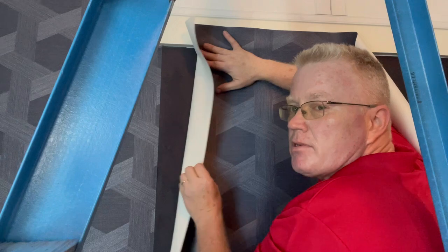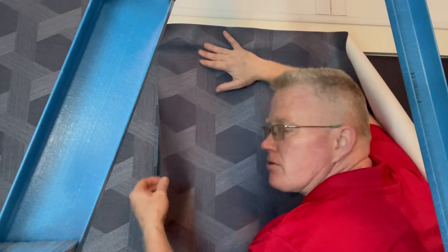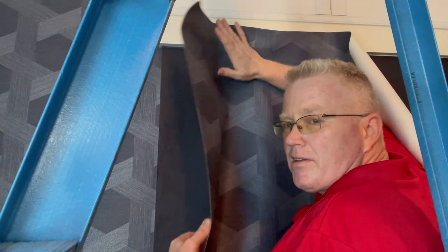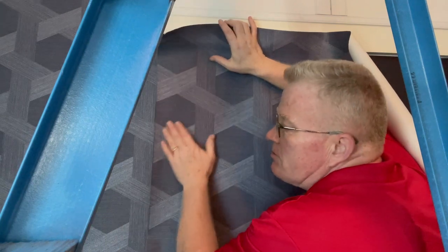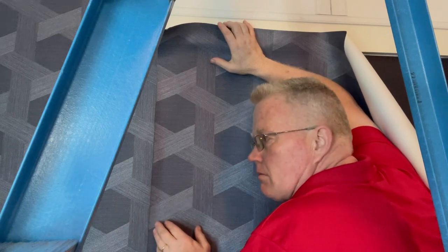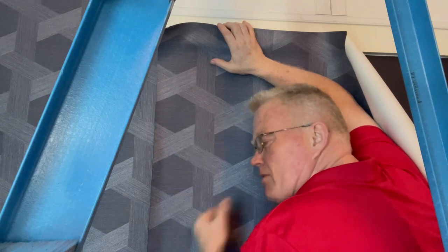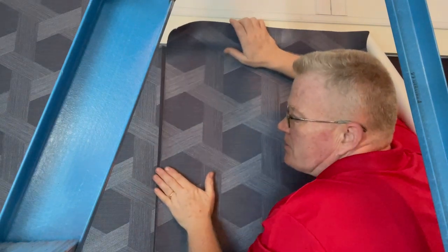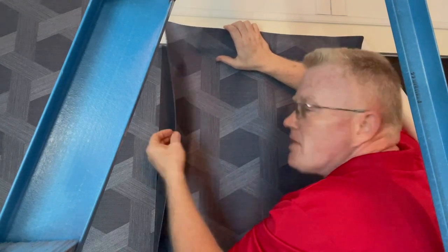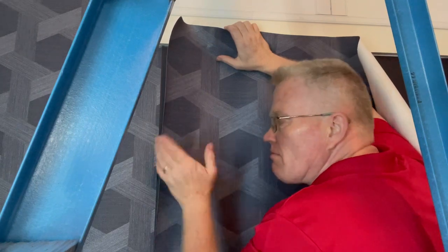What does that mean to the new person? It means this vinyl, when you have vinyl that's so wide, the edges are very, see how the edge is kind of wavy? Well, in order to make this edge lay down properly, you double cut it so as to make the edge very sharp and tight. You don't butt this kind of vinyl. The edge is never gonna lay down. It's been wrapped up, it's been in storage. It's never gonna lay down.